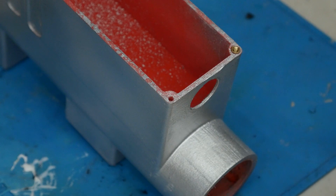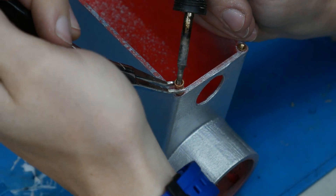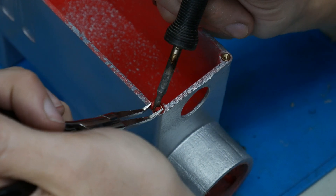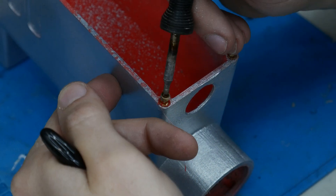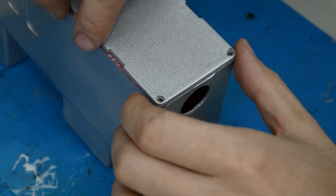I like to use real metal screws in my 3D printed projects, and threaded inserts add that functionality. Simply grab them with some pliers, place them where you want them to go, bring your soldering iron, heat that sucker up, and then discard the sample piece because you didn't make the holes the right size, and then add your actual final piece to it. As simple as that.